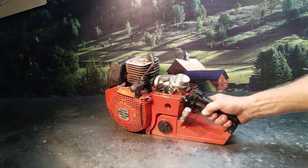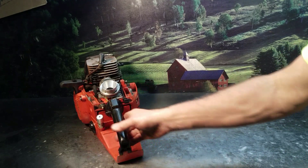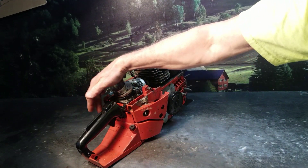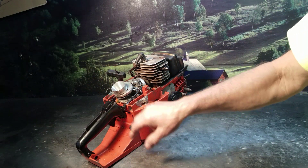They had some unique features, one being the oiler. You could put it on either side — left side or right side. That's what this plug was for. You take out the plunger on the right and switch them, and you have the plunger then on the left side.